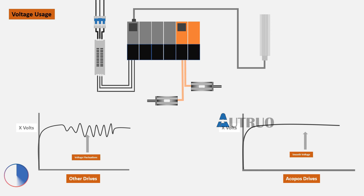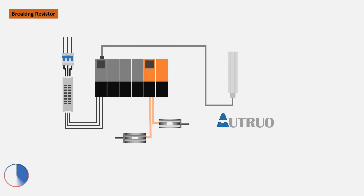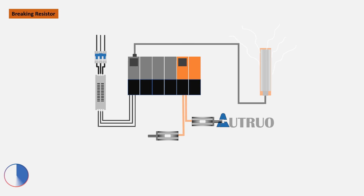Integrated Power Regeneration Unit: All 8BVP active power supply modules are able to regenerate power. Instead of the energy generated during braking action being converted to heat, as is usually the case, kinetic or heat energy generated by the braking resistor will be converted to electrical energy.